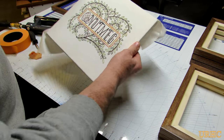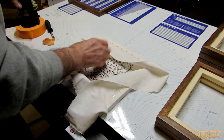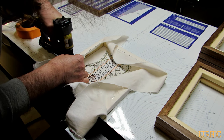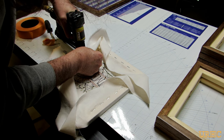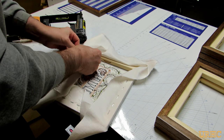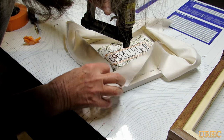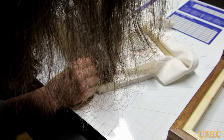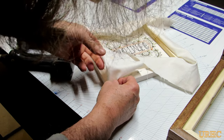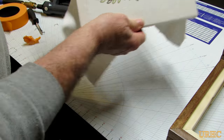I got all sides stretched with just a couple of staples in case I needed to pull them out later, and once I knew it was good and in position, I went back with the stapler and filled in all the areas with a couple more staples. This pneumatic stapler really makes jobs like this — or upholstery where you have to put a lot of staples in — really easy, because those old Arrow T50 type guns can be tough to squeeze after a couple of staples in and sometimes make things slip.